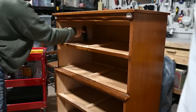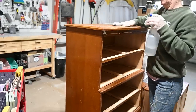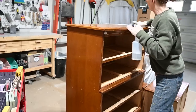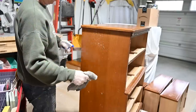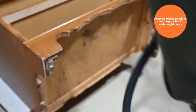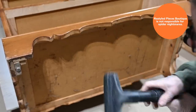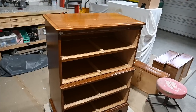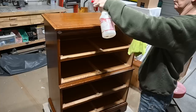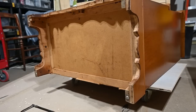Here I'm cleaning out the inside. I always vacuum out my pieces well. Then I use Crud Cutter — it degreases and gets your piece clean. So when you go to sand, you don't sand any of that dust or dirt into your piece. Look at the underside — so gross! After that's all clean, I take plain water and rinse it because you want your cleaning agent cleaned off before you prime or paint.